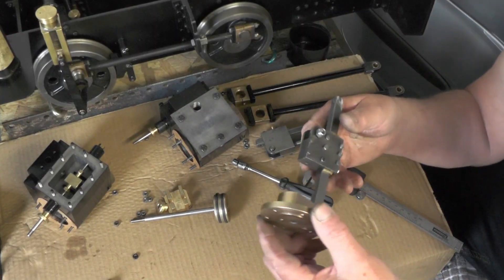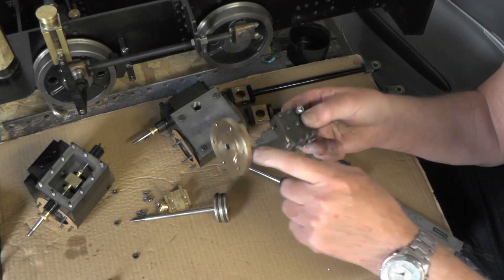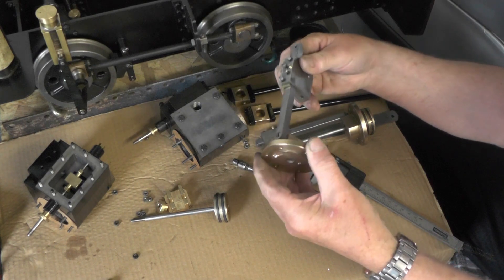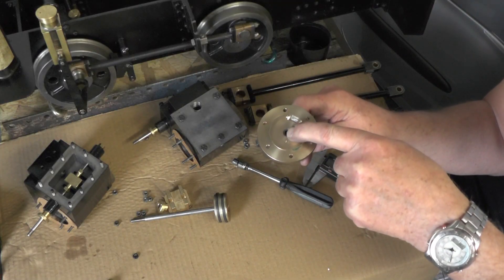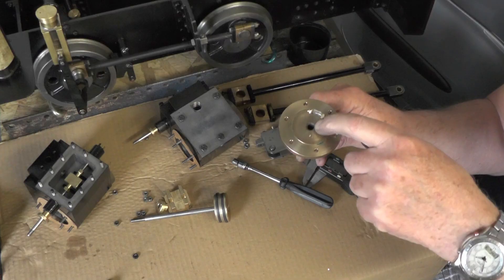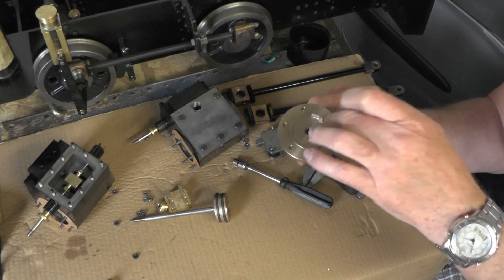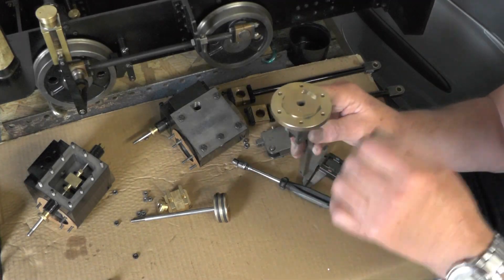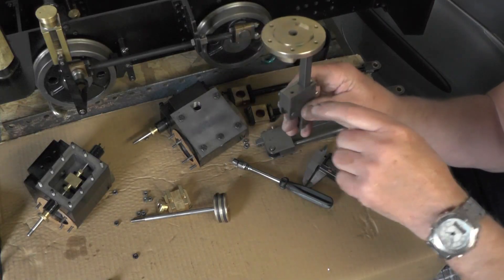So what you're supposed to do — and what I actually did, but for some reason drilled it off — you put your cover onto your slide bar, put your cross head on the slide bar, then you slide your cross head up to the cover and come through with a transfer punch of a suitable size. If you haven't got the correct size punch, you can either make a bush or make a punch to fit the cover, which is a quarter inch diameter I think. Once you're in position, you punch through into the cross head to get your hole position.